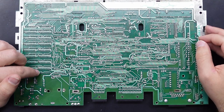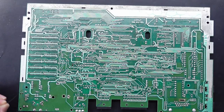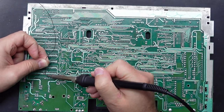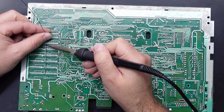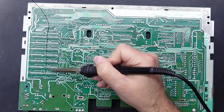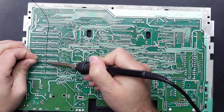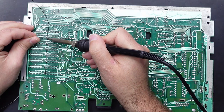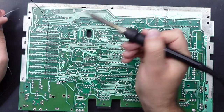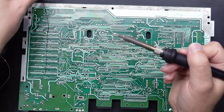The first thing we need to do is connect pin 1 of all these RAM ICs together, and they go through a 33 ohm resistor to pin 12 of the GAL, which is the first lifted pin on the top row. Now, I didn't strip the wire for any of the other pins — I literally just burnt through it with the soldering iron. I'm just going to go back through and touch all that up with some fresh solder to make sure we've got a good connection.